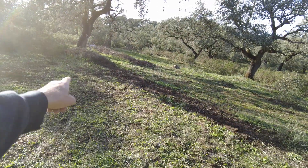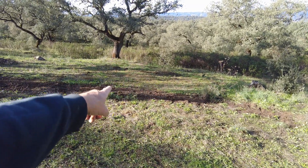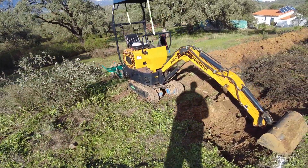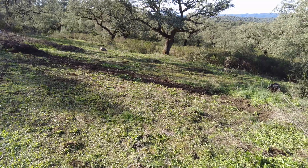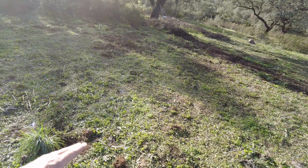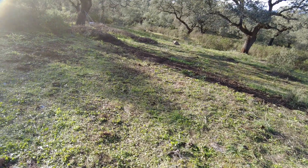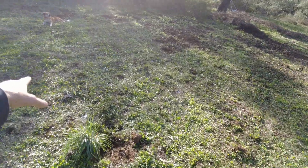This will be the wall. Step one: remove the topsoil and push it down beyond those little trees. Step two: dig a trench here — I think it's called a key trench — about a meter wide. Then take proper clay, fill it, run over it with the excavator. More clay, build a wall of clay in this area, going deeper this way.